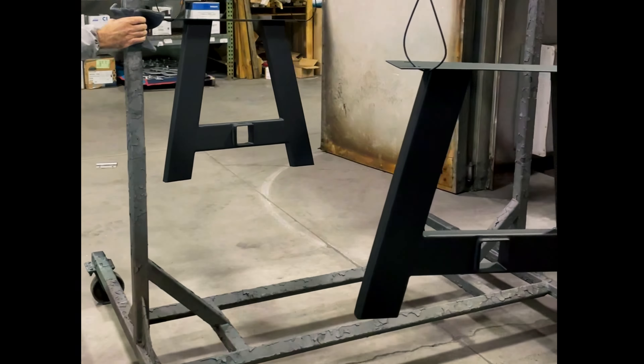One of my friends and neighbors was nice enough to come help me flip this thing one last time. The top was already sanded to 80 grit, so I filled the most noticeable cracks in the grain with Starbond Clear Adhesive and Activator, then sanded it all back down to 80. This took an hour or so, as I had to refill some of the cracks a few times.